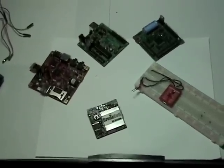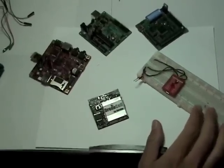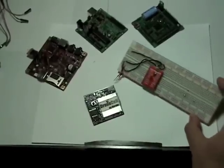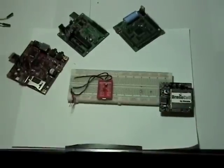The DroneCell can be easily interfaced with nearly any microcontroller or computer, so you can get your system up and running in a matter of minutes. The DroneCell was designed with the prototyping environment in mind. It's breadboard compatible and can be powered by any voltage between 5 volts and 16 volts.